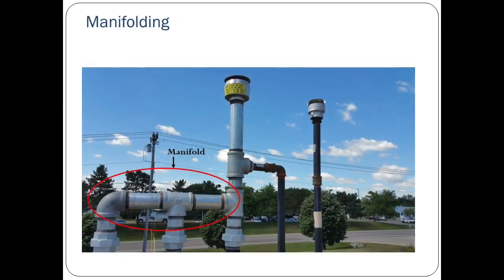Turn your manual to section 2.1 to follow along with this information about manifolding the vent risers. The vent risers must be manifolded either above ground or below ground to allow pressure equalization between each of the underground storage tanks. VST recommends that both the vapor inlet and the vapor return lines be connected to the vent riser corresponding to the lowest octane UST.